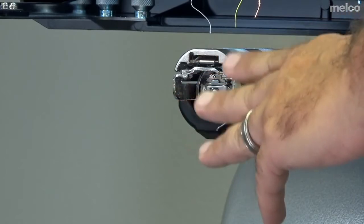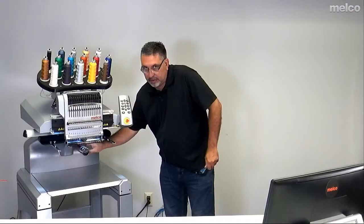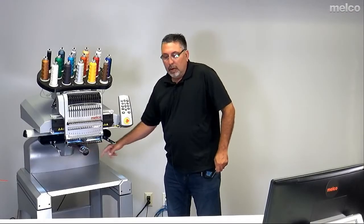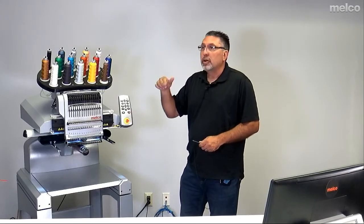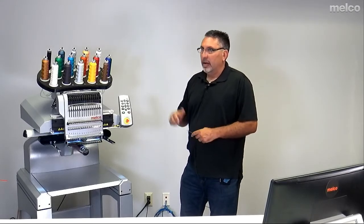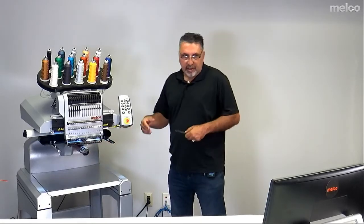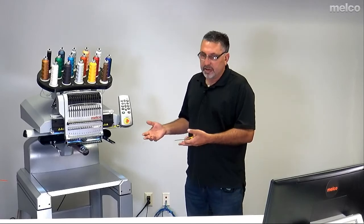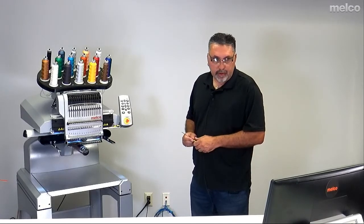So you can see now I have got the needle plate centered. You replace the cover. Oh, sorry, yep, and then you do just slide the cover back onto the red lower arm. On the back side of that silver cover, there's a little notch that indicates the back of this cover. Okay, so at this time I've completed my 2 million stitch maintenance for my NPT trimmer.